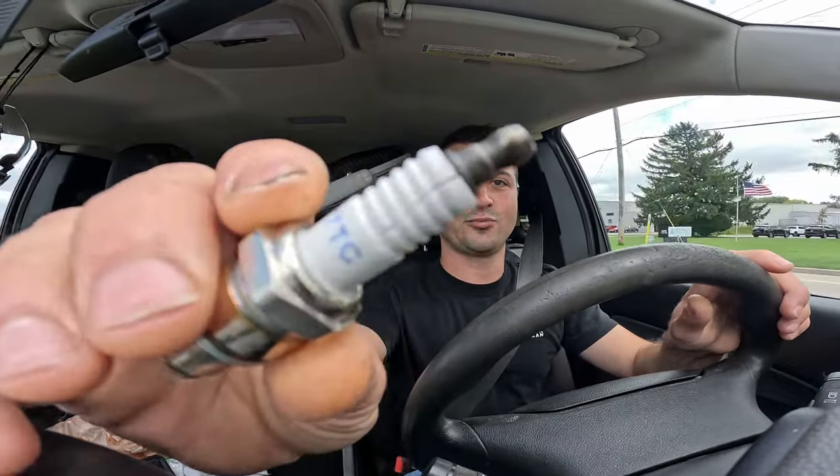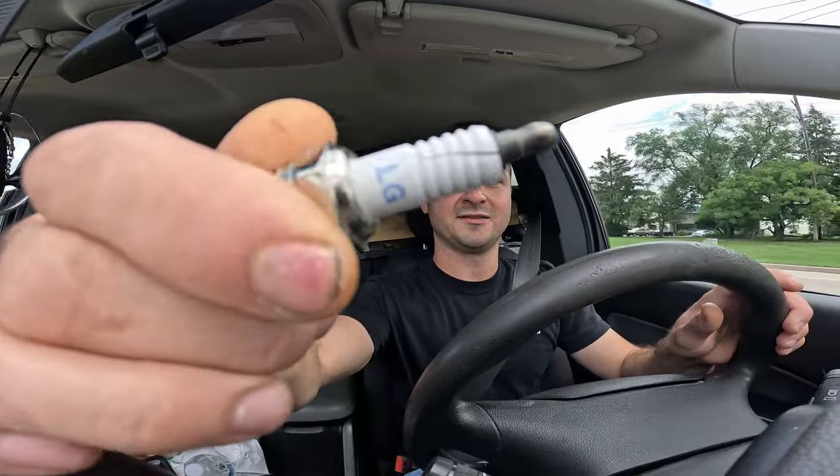The cover on the outside wasn't popped in all the way — not a big deal. Then the filter wasn't hooked in at the bottom. There was a drain tube that was supposed to go through the hole at the bottom but wasn't in the hole. I fixed all that, started it up with propane, and it started backfiring — bop bop bop. I checked the spark plug and the spark plug is cracked — brand new unit, brand new. I'm hoping you guys can see that.